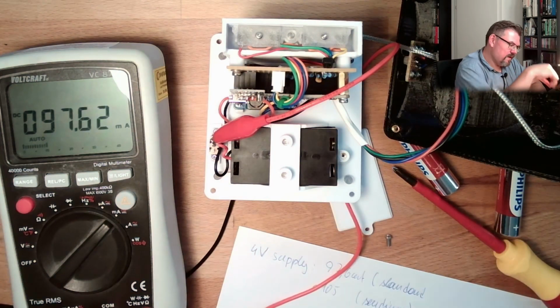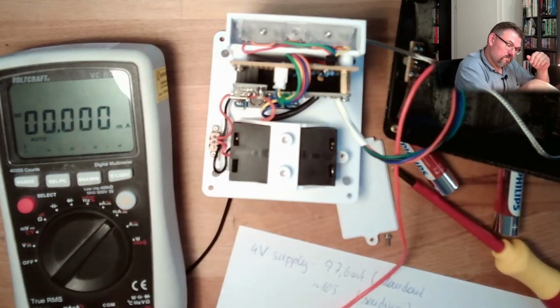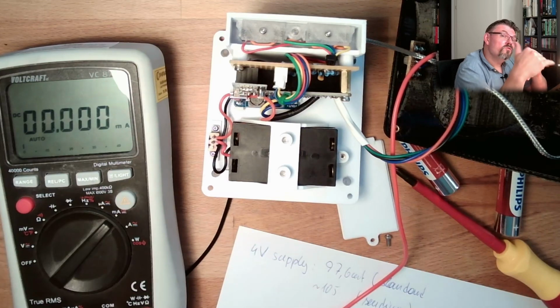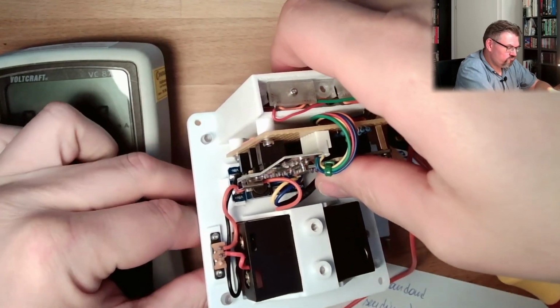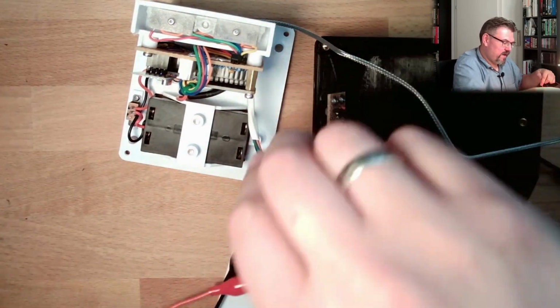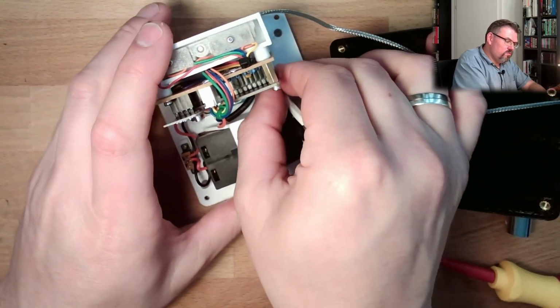First measure, hardware measure. I'm using here now a DC-DC converter to go to 9 volts. Then I'm power supplying my Arduino, which is using a DC-DC converter to go to the internally used 5 volts. And this means I have 2 DC-DC converters in series. I really don't need this because every DC-DC converter has a certain efficiency, right? And so I waste efficiency because I'm using simply two of them.